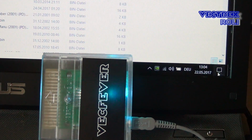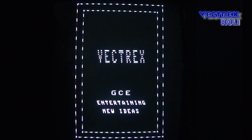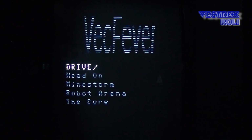When we boot up the Vectrex with the VecFever plugged in, we can immediately see that this is a modern menu-driven solution with all advantages and disadvantages. A menu is of course the most convenient way to select the ROM files, only in certain rare cases when you want to use a custom-made special controller for a certain game, you might not have all buttons available on such a controller to go through the menus, and you either have to use the original game card or a solution without any menu like the Matthäus card, which has a rotary selection switch to select your programs.